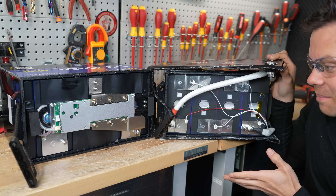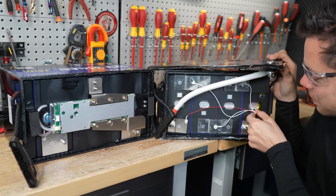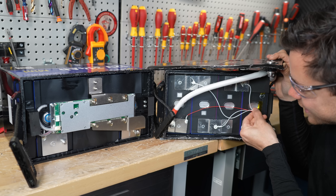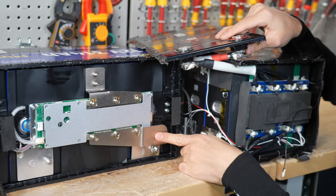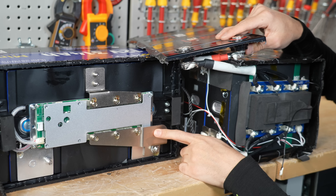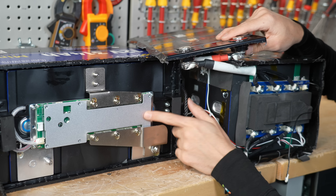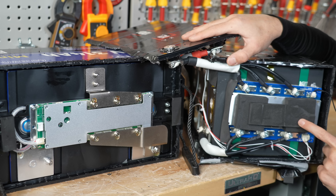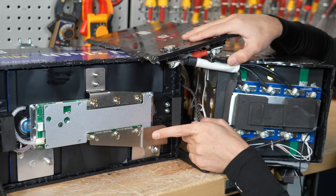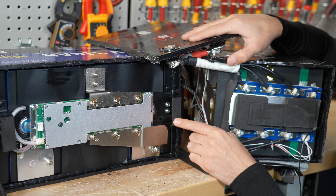The difference between these two batteries is pretty embarrassing — this is on a whole different level. The cheaper battery does work, but the balance lead is not protected and the BMS is just strapped on, whereas on the Watt Cycle it's actually bolted down. Look at these bus bars supplying the BMS compared to the other one. Also, the heat sink on the BMS of the cheaper battery is covered with foam, which could cause it to heat up more — but not on the Watt Cycle.